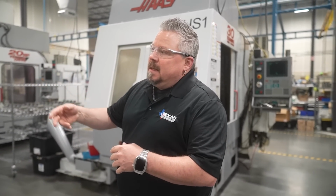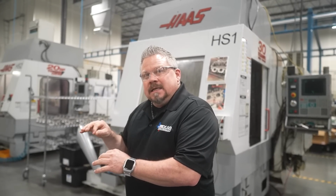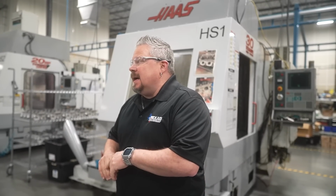It's important that the customer sending heads in does that step. When they come in, we have a teardown guy in the corner over there. He tears everything down. They keep everything in a bin for that customer's set of heads. Then we dump the heads and send them out for blasting. We have an outside source that blasts and looks for any broken bolts. When they come back, they get inspected again, then they get loaded in.